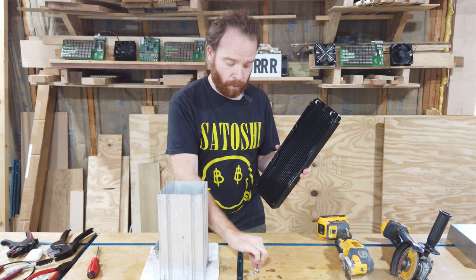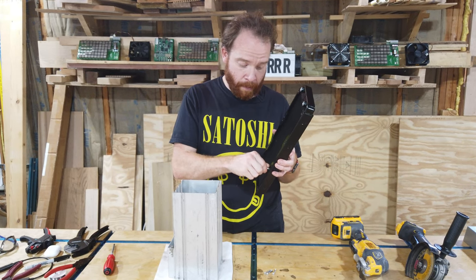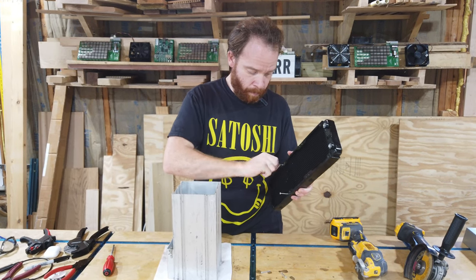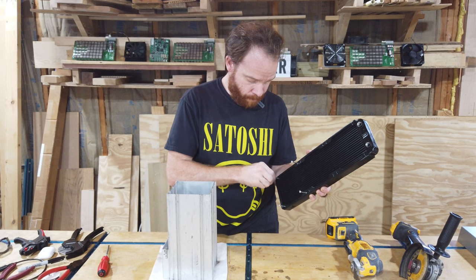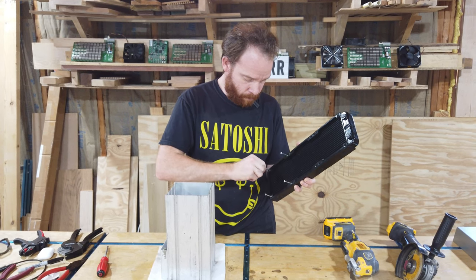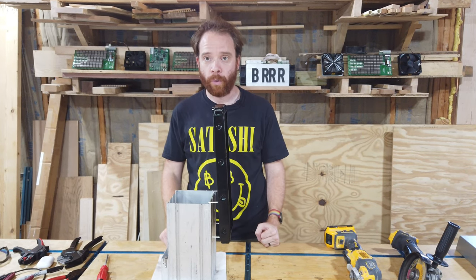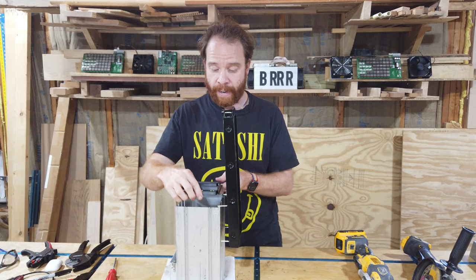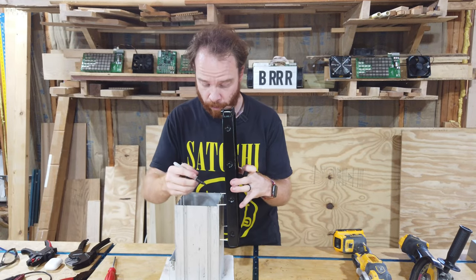It turns out that most of these radiators come with standoff screws that are made for the fans to attach to. If we screw four of them in only at the bottom like that, we can put it right away and mount it to the S9 casing. The problem is, we're also going to have a top plate that is the holder for the power supply, and this one doesn't fit anymore because the screws are coming out. So what we're going to do is mark the location of the screws with a Sharpie.